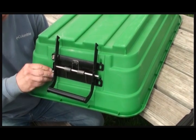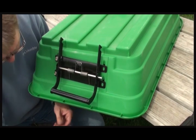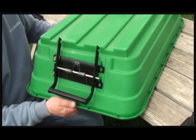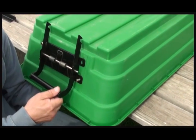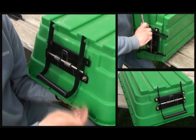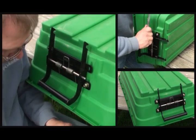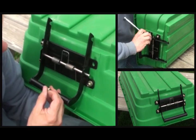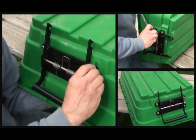Bolts should just be snug. Next, attach the tub latch to the cart tub. Insert panhead bolts from the inside and place latch assembly over the bolt. Add washer and lock nut. Align the remaining holes and repeat to install the three remaining bolts. Do not fully tighten at this time. Allow latch to remain loose so it can be adjusted after installing the front axle and frame assembly.